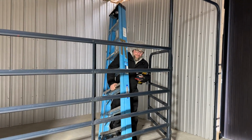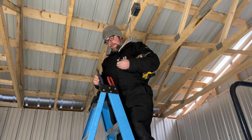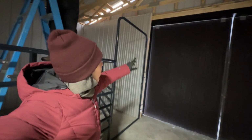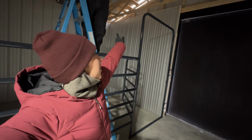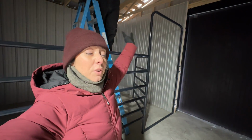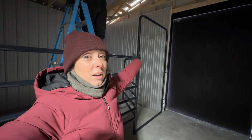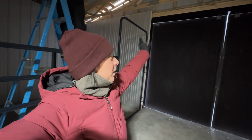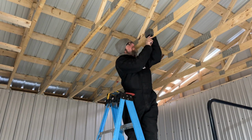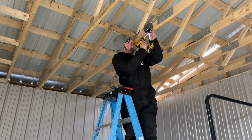Dope. Testing out the walls. It's getting dark in here with all the doors up now. So right over here, you can see a lot of light exposure. The soffit fell down during that big windstorm because we had decided only to go every other with a nail. Some people don't even put any nails in to hold it. Well, now Al's gonna go back and put a nail in every single one, so that way it doesn't do that again, hopefully. And then I had to order outlet covers. They had black outlets in stock, but they did not have the covers for them. Kind of weird.